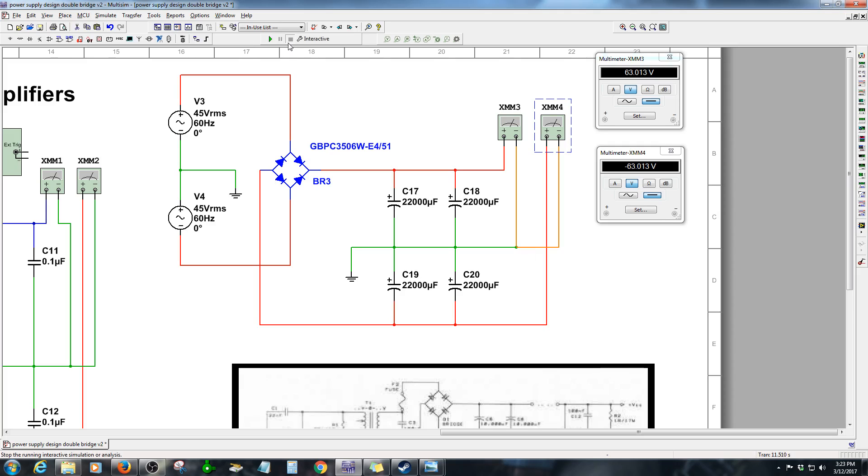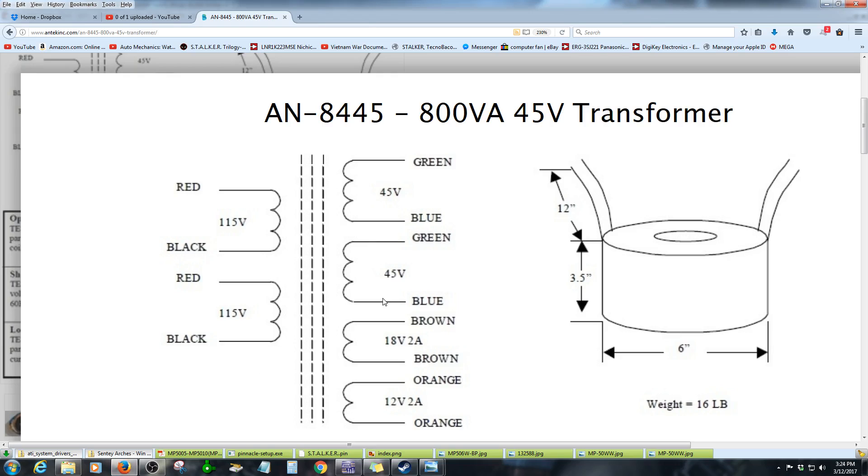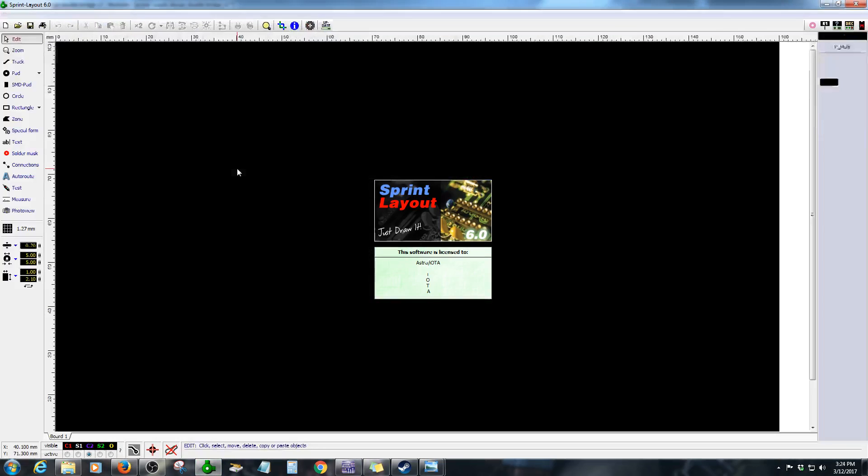You can see we get 62 volts positive and negative 62 volts, with ground right here. This is the simple circuit we are used to: one single bridge rectifier. But in the dual bridge design, the windings of the transformer are not going to be in touch with or connected to the amplifier circuit, so it's going to be isolated from AC signals, noise, and distortion. The website I found this on has more accurate information than my brief description here.